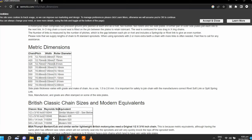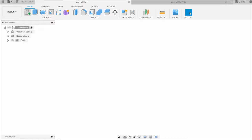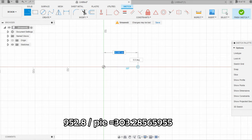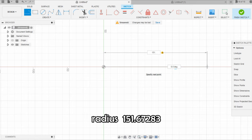I'll show you how you can draw one yourself. I just Google the dimensions for 520 chain — that's what motocross bikes have. The 525, 530, and 532 are all the same just different widths. You take the 15.88mm pitch dimension times 60 teeth, divided by pi to get the circumference, which gives you the diameter. Divide that by 2 and it equals 151.67mm — set that as your radius.